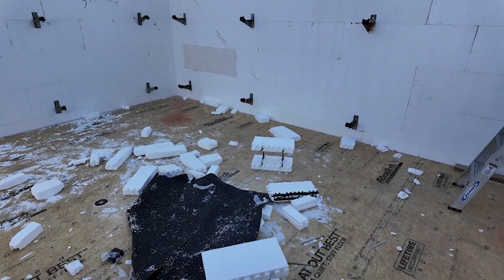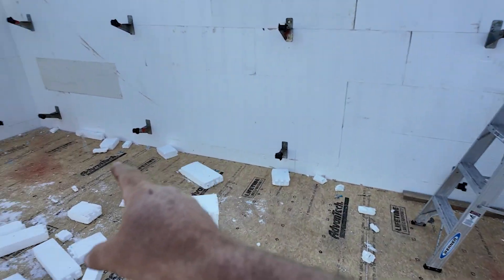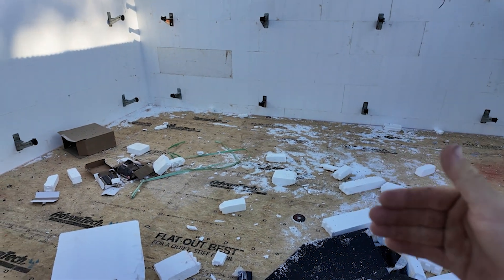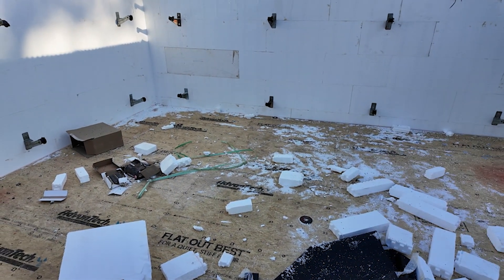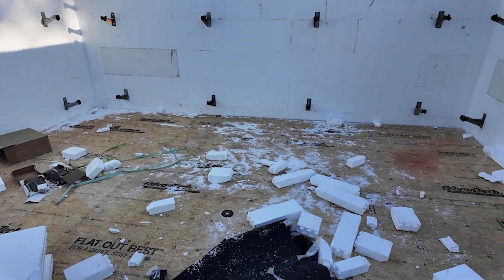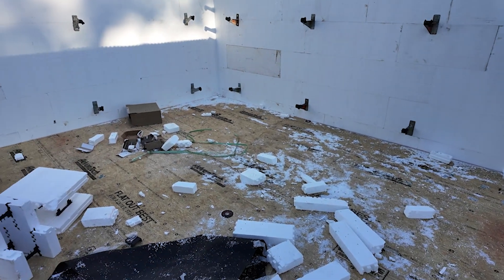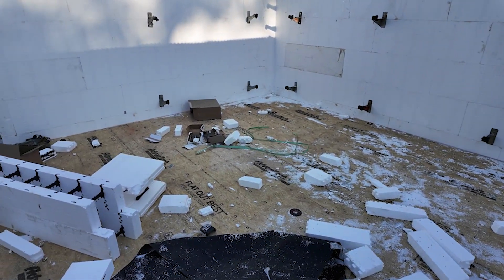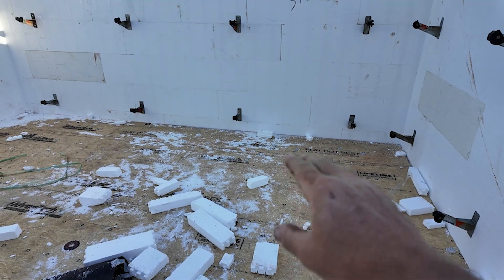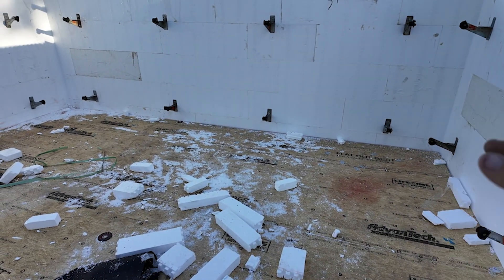Basically because of the way we're doing this, we have anchors all the way around here — cut windows into the ICF — and we put tar paper in and put a bolt through the rim board. Now those aren't doing anything until after we pour concrete. So right now, this entire floor is just hanging on ICF screws, which is fine for temporary. We're not putting a lot of load on it right now. And we went in and put cribbing under this whole floor around the perimeter down to the footing.